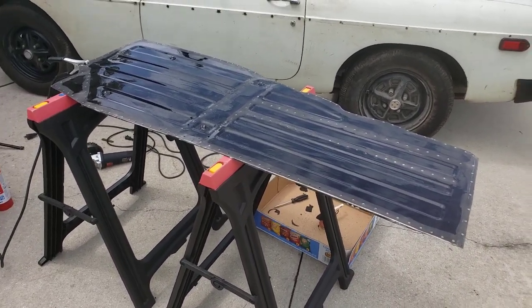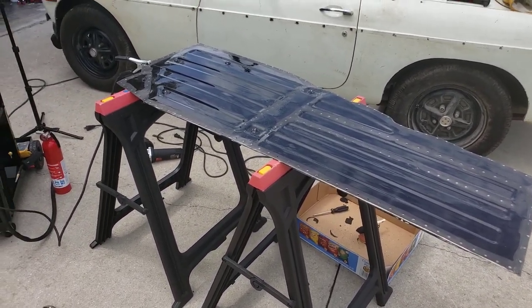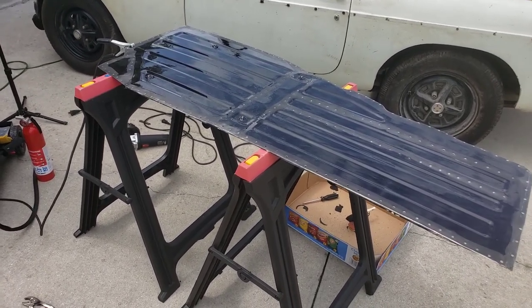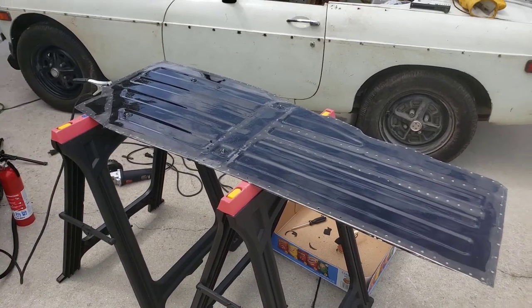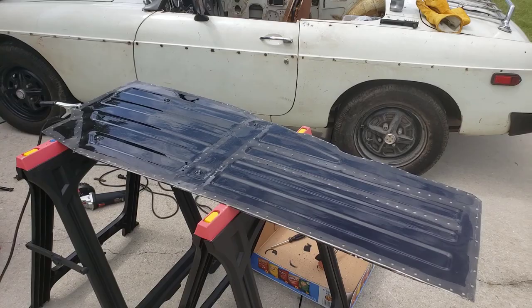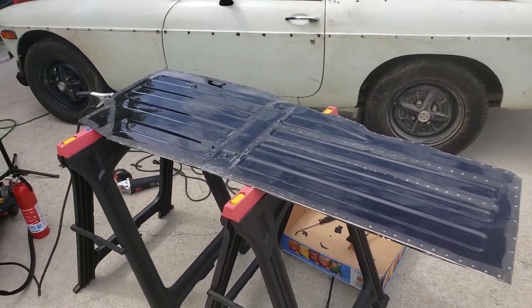And then what we're going to do is pour POR all around the seams, let it soak in, and hopefully that'll take care of all the other bare metal I wasn't able to reach. I've got 6 cans, so I should have plenty. One can does like 6 square feet, 2 coats. So, yep, moving forward, guys.